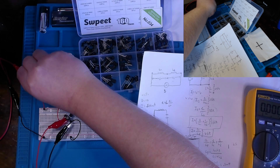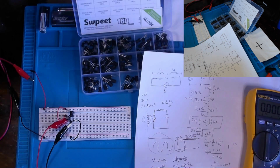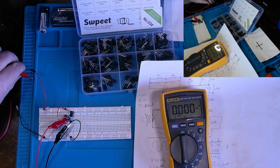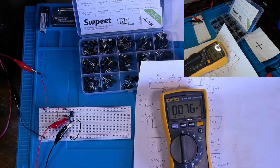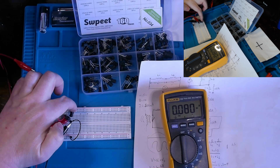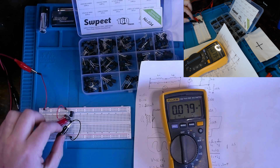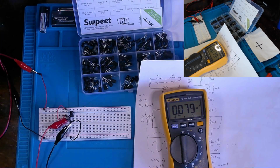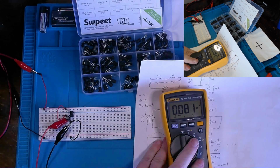Oh, it's a bit off here on camera, but let me hook it up. What I've done is gone ahead and took my multimeter and lifted one leg to one of our inductors and put it in here. That way we're just measuring current down one side, but we're only seeing about 80 milliamps going across basically L2.